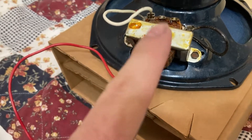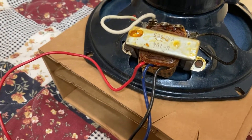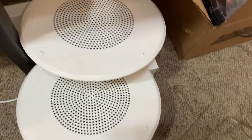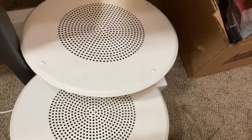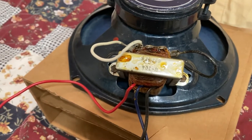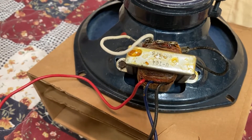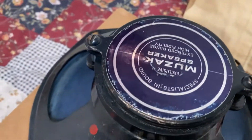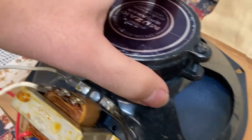This transformer is actually a little bit different from what I'm used to seeing on your typical 70-volt speakers, like these two here. You have a bunch of wires that come out, and you obviously search for your common wire to rule that out first, then look at the tap chart — either through a legend on the back of the magnet or on the transformer. But this one was quite unique.